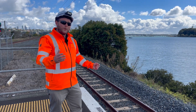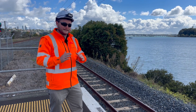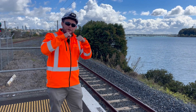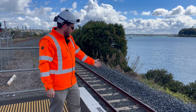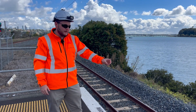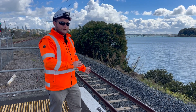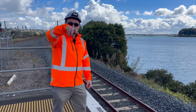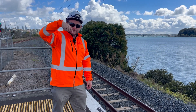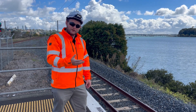it is standard practice to then grind the correct profile in, and that's where you can see we've now got a silver band more in the centre of the head. Whereas originally, when we run in those early months once the new rail is installed, you tend to get a shiny band on the corners of the rail on the gauge side. So you can see here that there are some rough marks, and those marks are the grinding marks that are wearing in. When we use a big grinding train that goes through with grinding stones that spin,